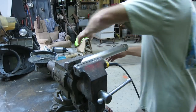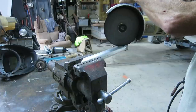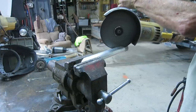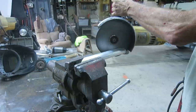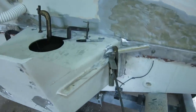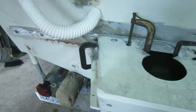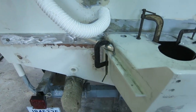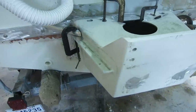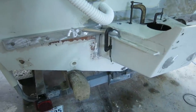I ended up using the miter saw to cut it close — it would cut a 45 but I really needed like a 52 or 53 — and then the big grinder with a cut-off wheel made some sloppy cuts but got them pretty close. It's heavy wall stuff so it's easier to fill a weld gap. The first pair of braces are cut, fit, and clamped into place. I'm now going to tack the whole thing together — right now there's just clamps holding the engine pod to the flange.